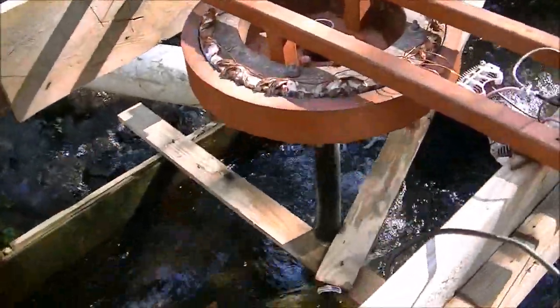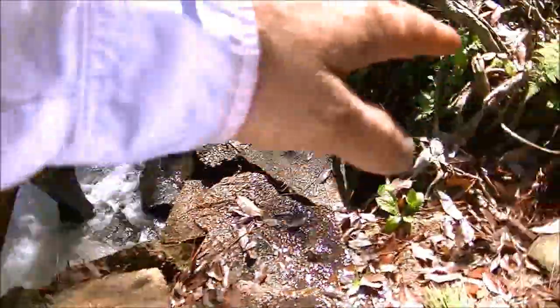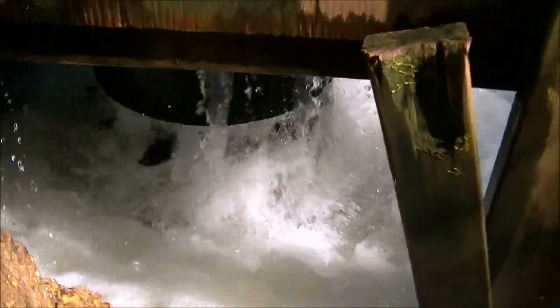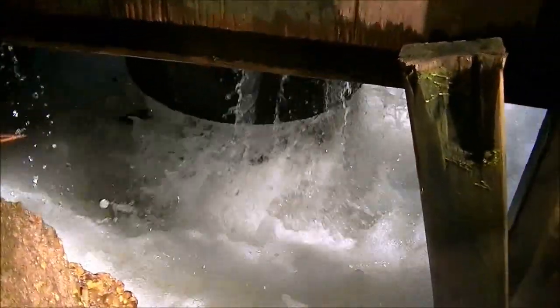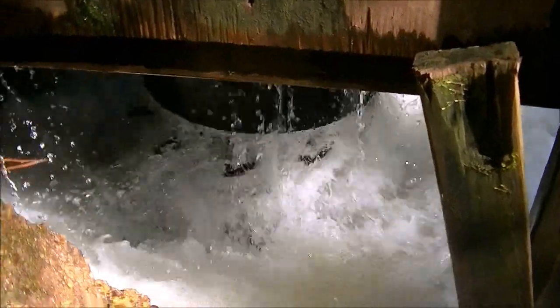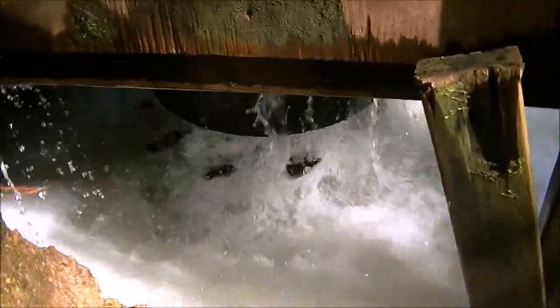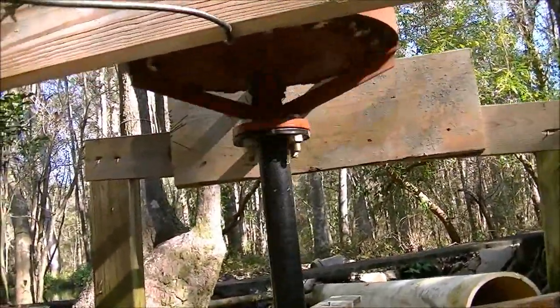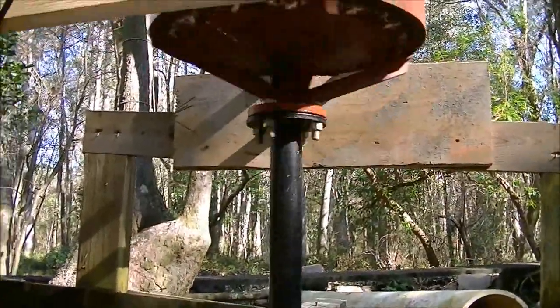It's very low maintenance. There's a shroud that is a little smaller at the bottom than it is at the top — that funnels the water over the blade. I left a gap between the top of the blade and the bottom of the shroud to let limbs, pine cones, fish, and turtles exit without hurting anything. There's no gears, no chains, no pulleys. It's real simple direct drive. The only way to accomplish this is with a large generator.